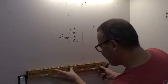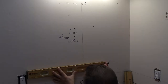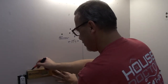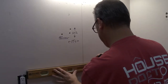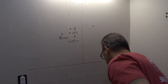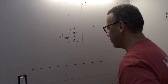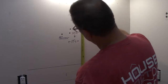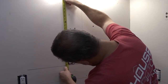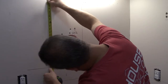Here I'm getting ready to mark out for the new medicine cabinet where it's going to go into the wall. You can see I put some numbers on the wall — it just makes it easy so I don't have to keep looking around for how high and how wide it needs to be. Start by making a level line where the bottom of the medicine cabinet is going to be. Take your time and make sure that's nice and level. Then you need to mark your height off of that, which in this case is 25 and a quarter inches high. Measure up 25 and a quarter off of that line and make marks at the top on the left and the right for the top of the medicine cabinet.